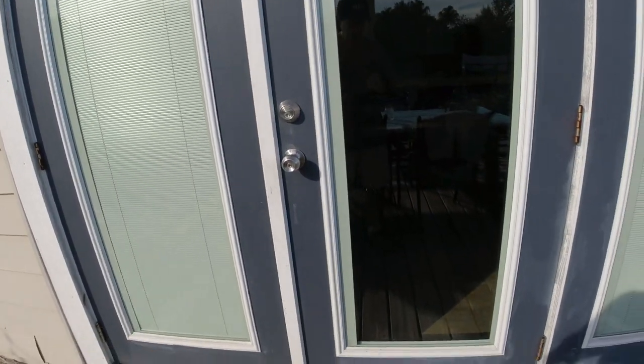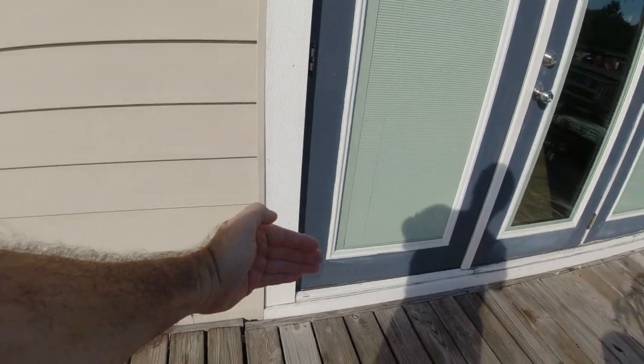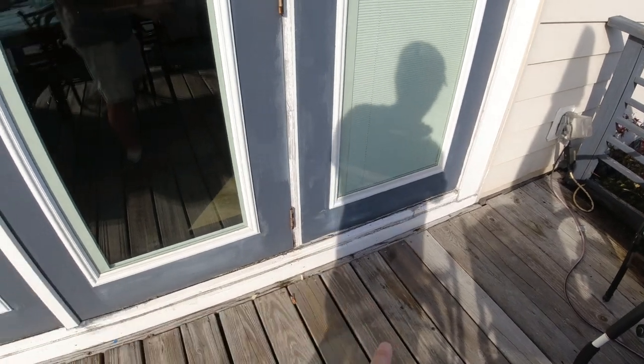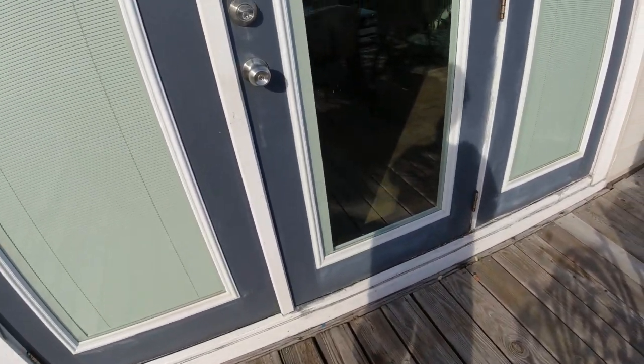Welcome to Keith Cage's garage for some more home fixing. There's a board that goes on the front of the house — a two-by-eight — that's rotted away. The deck is held up by piers underneath, but I also screwed it to that piece of wood that's no longer there. That's why it's squeaking — it's actually going down because it's not holding onto anything anymore.